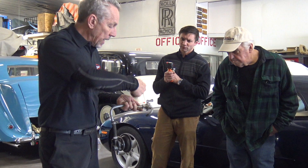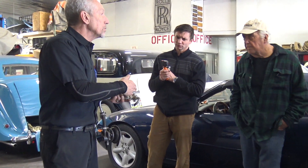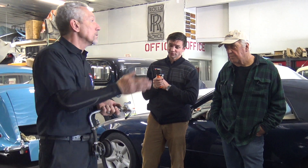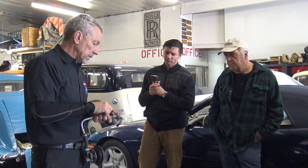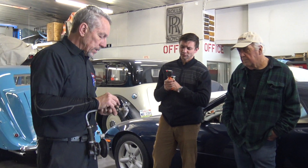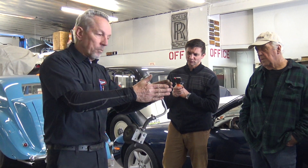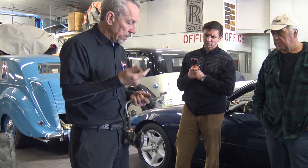Just so anybody who's wondering what this extra valve is for — this is a manual water valve, and they have a summer position and a winter position. The winter is more open, the summer is less open. They usually seize, they usually get broken, and they leak a lot. It's just a tapered brass piece that fits into a tapered housing. To fix them, you take them apart, clean them up, take some lapping compound in there and make a nice fit, free them up so that they can move again, and they're good to go.